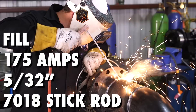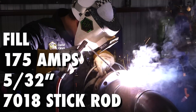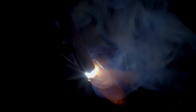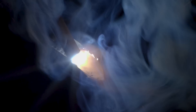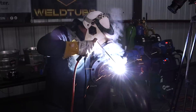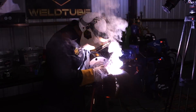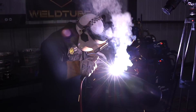Just do a nice clean pass on our fill. Staying up on top and rolling the piece this direction. I'm just moving my puddle, barely oscillating, just trying to get my puddle all the way up to almost the edge of the bevel. Got my machine at 175 amps, 5/32 7018. Let's continue a nice smooth fill. Depending on the size of the spool you're working, it can kind of get heavy sometimes on these rollout wheels. For a positioner it's probably a little bit better, but since this spool is pretty small, it's not too bad.